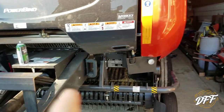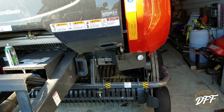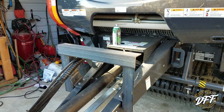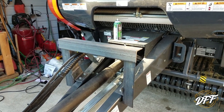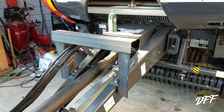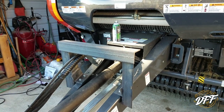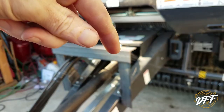But underneath the cover on the other side of the baler you can see there's a blank spot, and I'm actually going to put a second tank underneath that cover — probably a 15 or 20 gallon. It has to be a specific size, kind of a tall vertical tank, so I'll have to order something. That's why I just grabbed this one from Tractor Supply. I'll add a second auxiliary tank so that on a long day of baling I can just pump from the extra tank to the main tank up front.